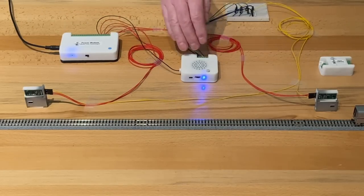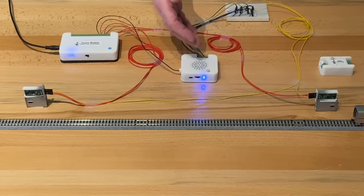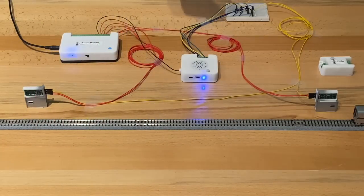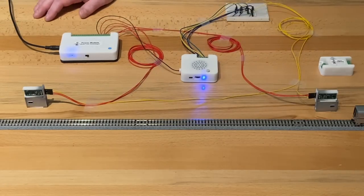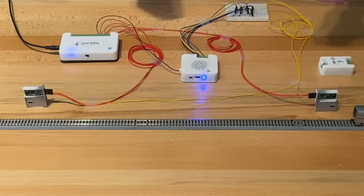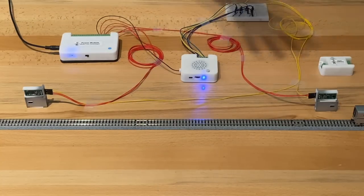You can also use a sensor for the ambient sound. Let's say you put a sensor somewhere out in front here, and so when people get close or you get close, the sound starts up. Or it could be another train on another track — any other sensor wire you can hook up in parallel to that, and so anything that comes near the station starts the ambient sound.